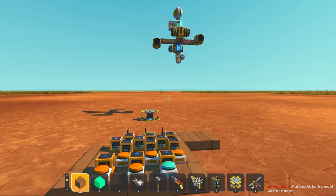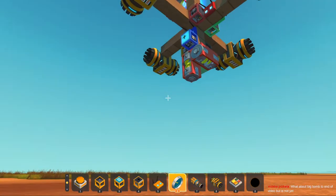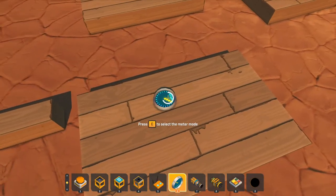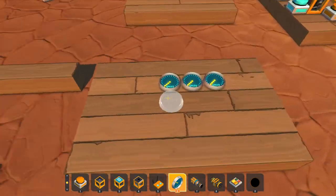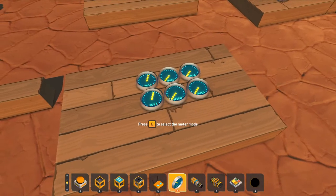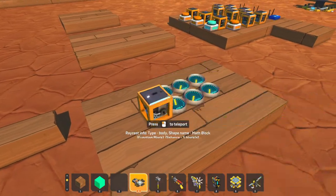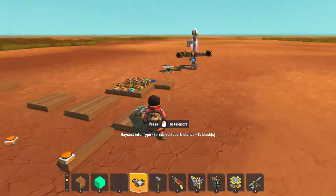There's another way that I can build this drone too, and that's with GPS positioning, which is a lot more similar to what I did in Plasma. In Plasma, the drone has its own XYZ position. And here, I would tell it a target XYZ position. You know what it is. Then on the drone, I just have a subtraction from the current and the target, and that number directly goes into the thruster for that axis.